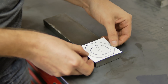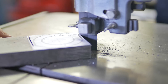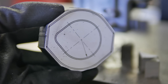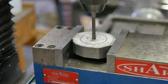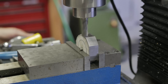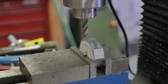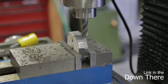All right, so we're going to start with this three-quarter inch plate steel. We'll make it out of two pieces and TIG weld it together. I'm going to rough out the shape on the bandsaw, but then clean it up on the mill. Dale at Building Something Cool showed us this technique for milling a radius on a center pin. It's a little time consuming, but it works surprisingly well.